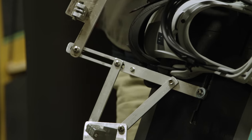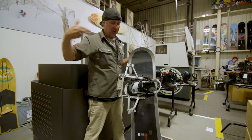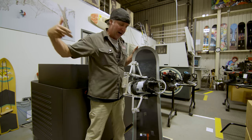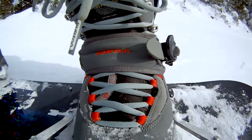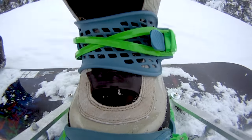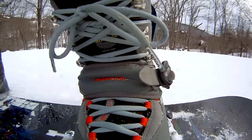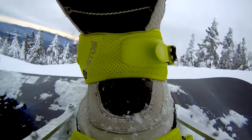I made a little halo out of scrap aluminum pieces from my shop where we were able to mount three or four GoPros at a time right onto the board, screwed into the channel. We watched how the foot rolls in a step-in binding and in a strap binding, trying to be proactive with the research and empathy of how a snowboarder uses a binding. You could see the old system on camera — a guy takes a turn and nothing happens — then you see our traditional strap binding and he takes a turn and it totally moves and responds with him. That was a big catalyst for setting up the critical engineering requirements.